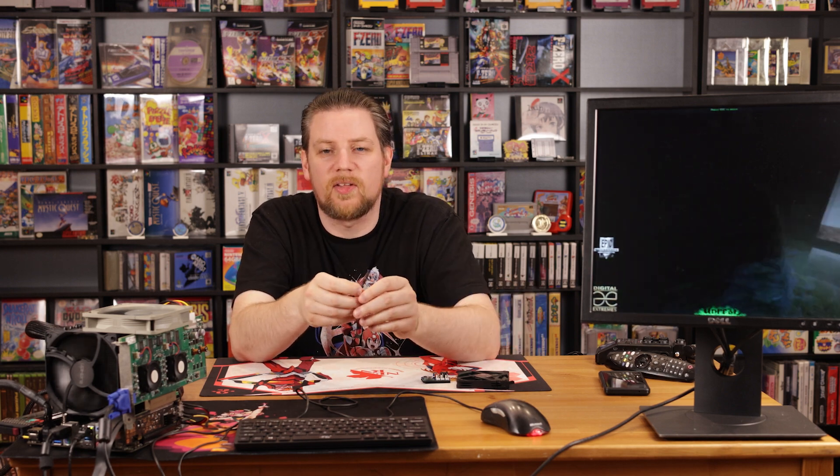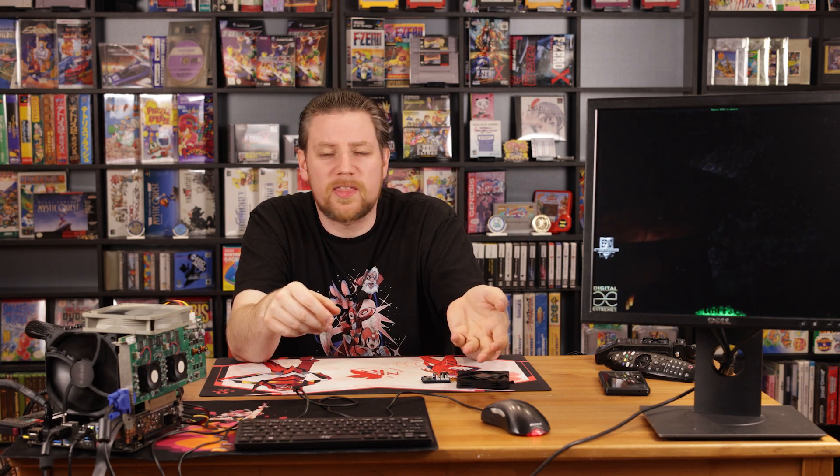I've modified or replaced the power supplies in each of my consoles to accept specifically a 12-volt DC input as its main power, rather than whatever they're designed to take — like 120-volt for the Dreamcast, or 9-volt for the Super Famicom. By doing this, I don't need any big bricks going to my consoles, and I don't need a bigger and bigger surge protector. This way I have one plug going to the wall, and then this handles the power distribution to everything else.